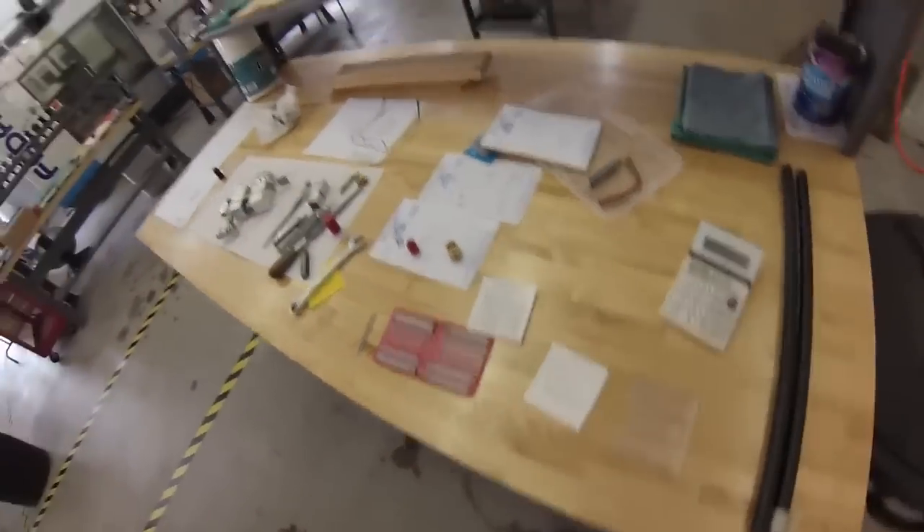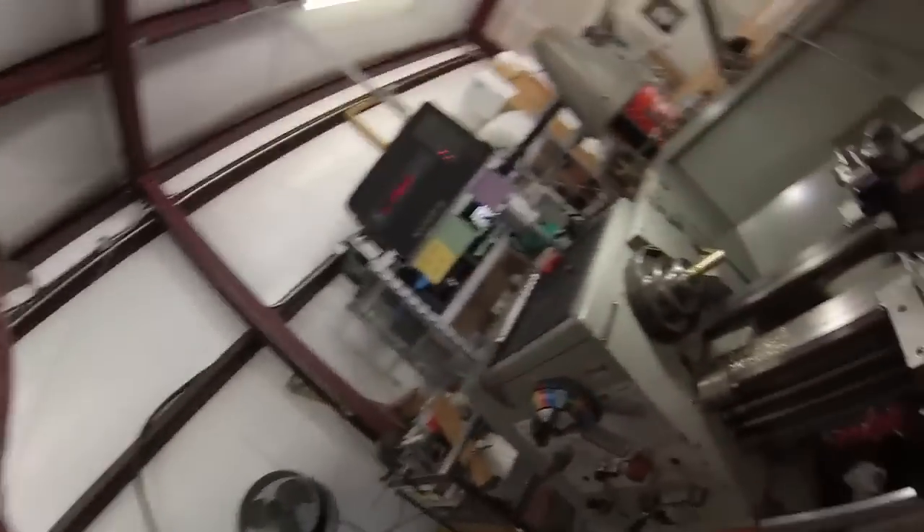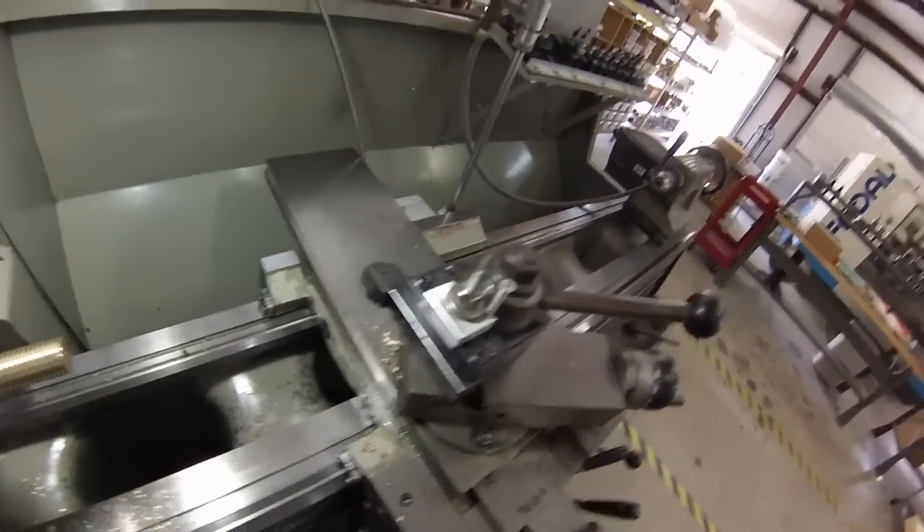So get yourself a set of these wires and one of these charts. If you don't have a machinist handbook, it's about three inches thick, costs about 60 bucks — us old-timers call it the Bible — so get one of those too. Okay guys: upside-down tool, thread out, machine in reverse. You can increase the RPMs of the spindle because it's not a matter of coordination and timing to shut down your carriage and disengage your half nut. The tool ends up off the part — it's a lot easier, a lot faster, and if you try it, you'll like it. Leave me a comment below. I hope you like this. Good luck. Try it. See ya.